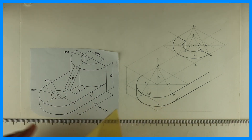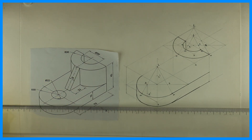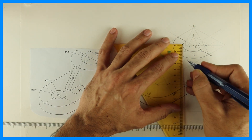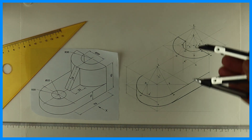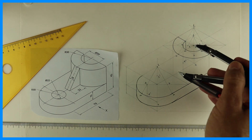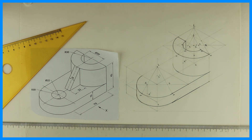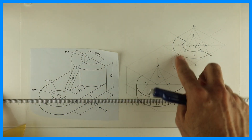Now draw this circle. It is 30 down, so from point one we'll go down by 30. From point four and point one of radius 30, go down by 30. This is one-dash, four-dash. Take one to M, copy the radius, and from one-dash draw the arc down. Same with four: take four to M and from four-dash draw the arc. These lines will be dark.